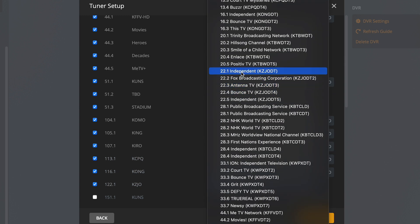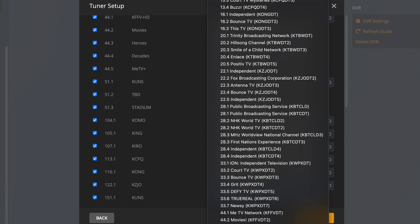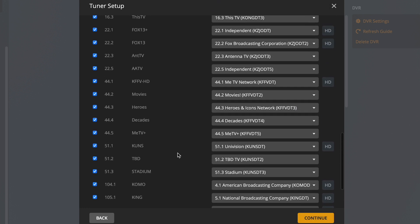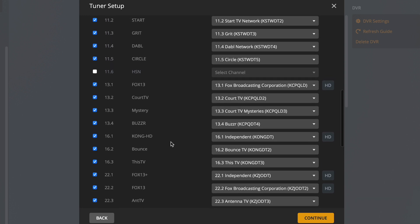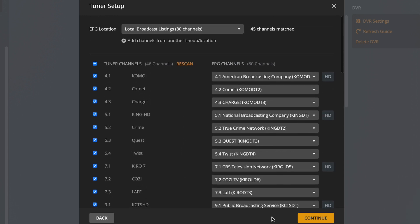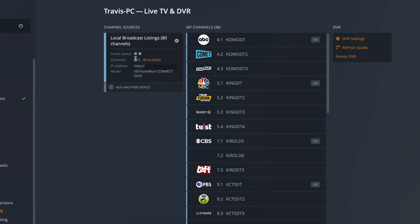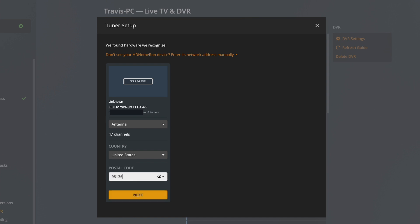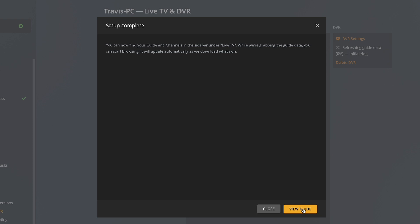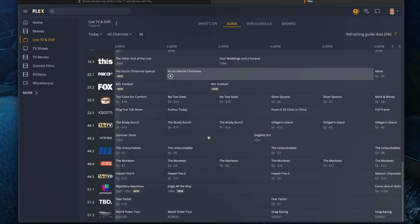I need to make sure I'm using the digital channels because the new tuner does not see the analog channels. After mapping everything and clicking Continue, it didn't seem to do anything. After trying a couple more times, I did a little research and found that Plex is not compatible with ATSC 3.0 channels yet. So I went through and added it without trying to add the channels that Plex can't deal with, and the guide is here — everything is up and running just fine, with all channels in the guide, just no ATSC 3.0 channels for now.